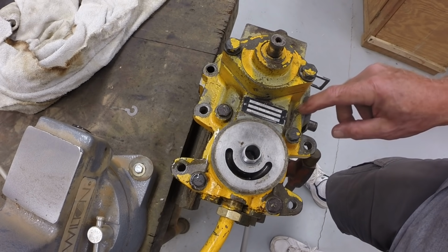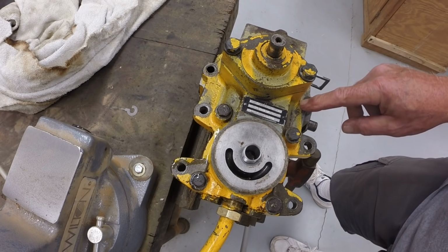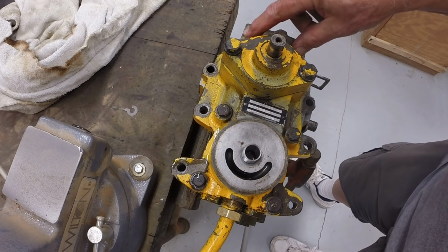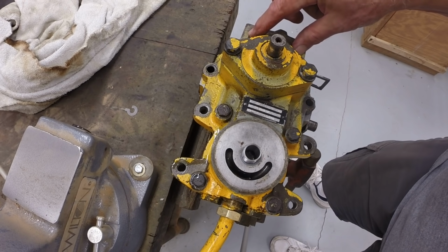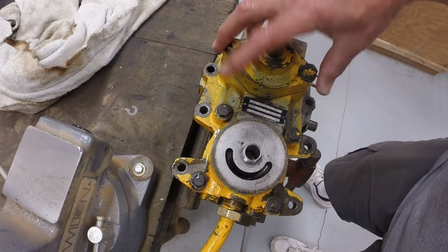And it provides hydraulic fluid at about 600 PSI. This is not a ported pump. The other pump we have on the other end of the tractor from the 1450 has hydraulic outputs, and they're really output from the charge pump. So this is a charge pump housing.